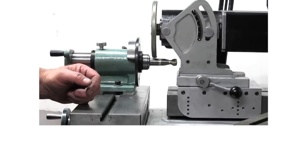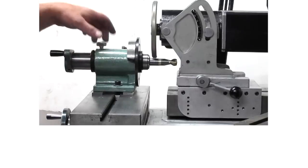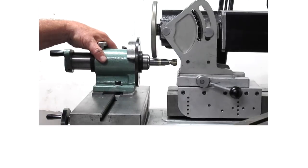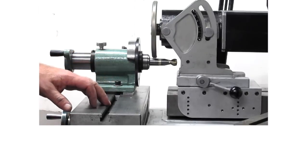We're grinding reduced necks. We have the machine set up on our riser just to get it up above the tool, then we just have a regular old 5C spin indexer and we just have it shimmed to some random height so I'll be able to produce a flat.